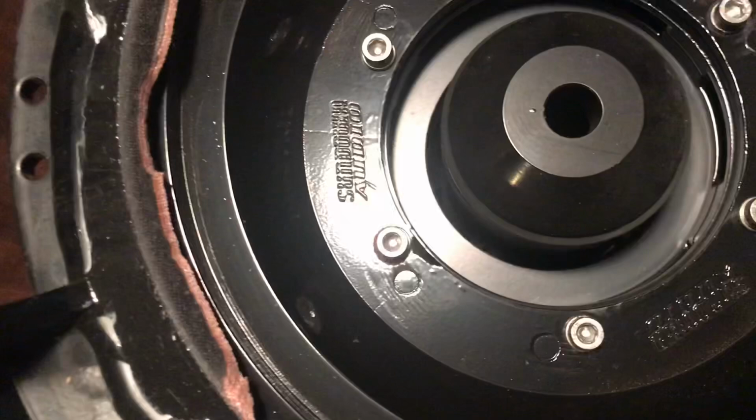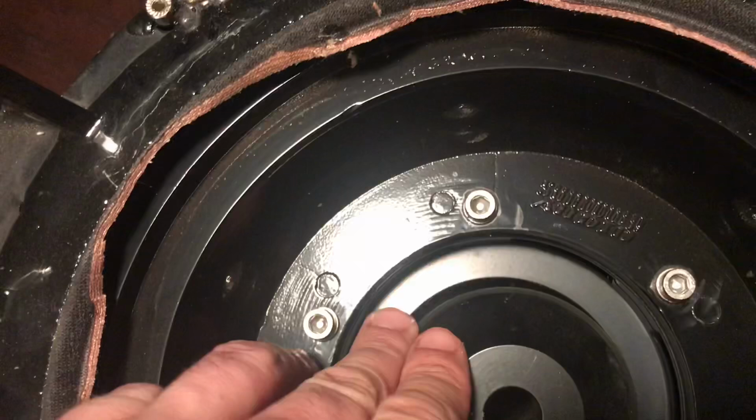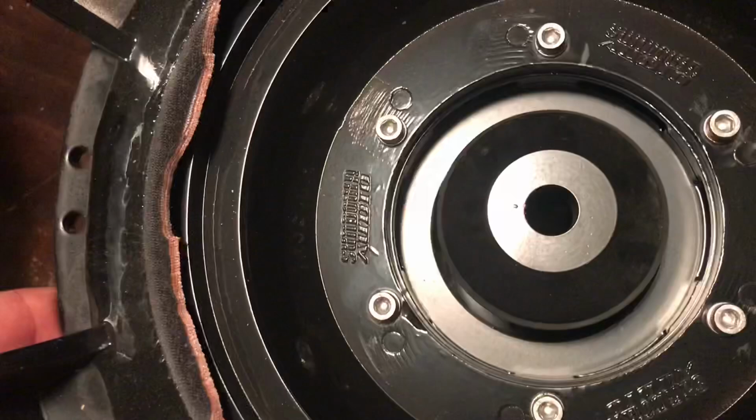Usually when it's blown, you want to go down in here, make sure you get everything out of the gaps, clean it all up. I'm going to clean it all up anyways, but it's extra important if you blow this up because you'll have pieces of the coil down in here. The best way I've seen it done is I've seen people take like a ruler or something that's a little bit flexible with tape on it, and they just go around and pick everything up. And then I usually spray it out with air just to make sure. However, I am going to recone this to an 18, and it wasn't blown.